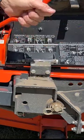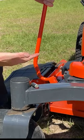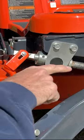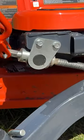Make sure the parking brake is set. Take the handle out of its little keeper here, then turn it clockwise — that will raise the mower. It pushes the axle apart and makes it scissor.